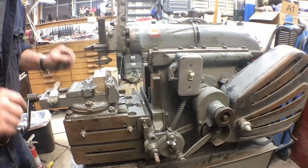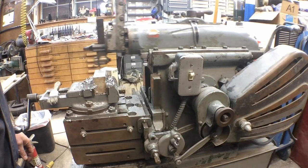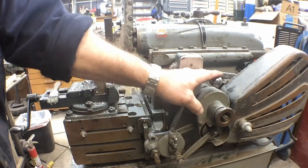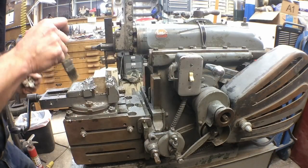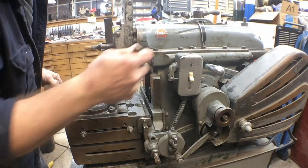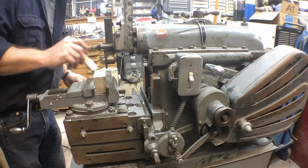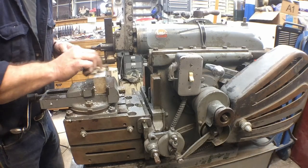We have finished our cut right there, so we can disengage our ratchet and it will just operate itself like that. Then to stop the machine you disengage the clutch, bring it to the rest position in the back, and power it down. The thing about the shaper is you're not messing with an expensive milling cutter — you're single-point tooling. They're really a versatile machine, though not very popular anymore because they're slow to operate.